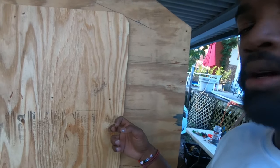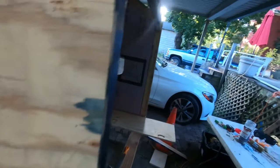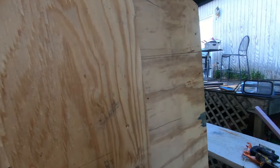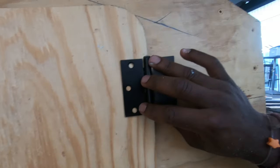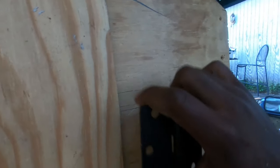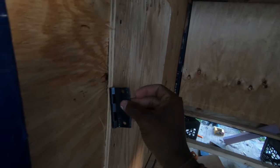So I'm going to go ahead and file it up and fit it in there — it's in there nice and snug. Next order of business is to take one of my hinges. This isn't necessarily the hinge I'm going to use — I think I'm going to use the same hinge I have on the rear. I'm going to come over here and take just the hinge as an example, set that there, and make a spacer for the right-hand side here so the hinge can sit like that and it's nice and flush so that it closes properly. Otherwise I'd have to finagle a hinge in here somehow, which would just get ugly.